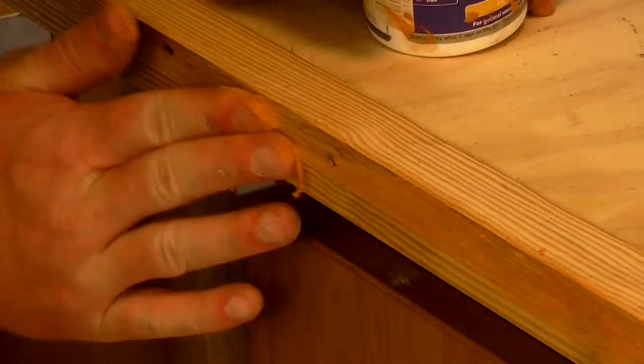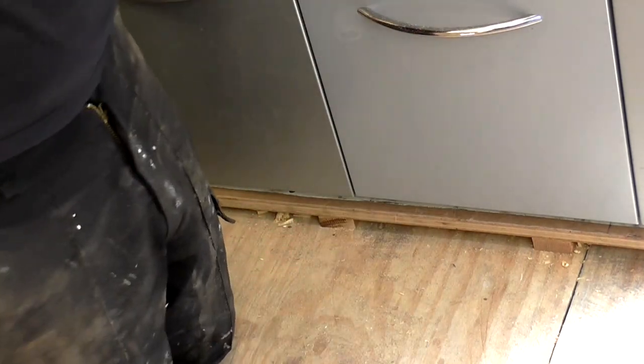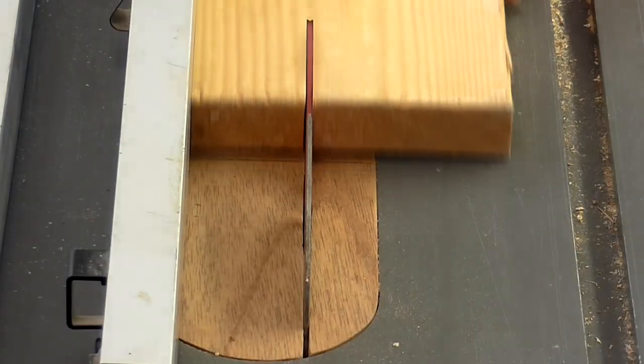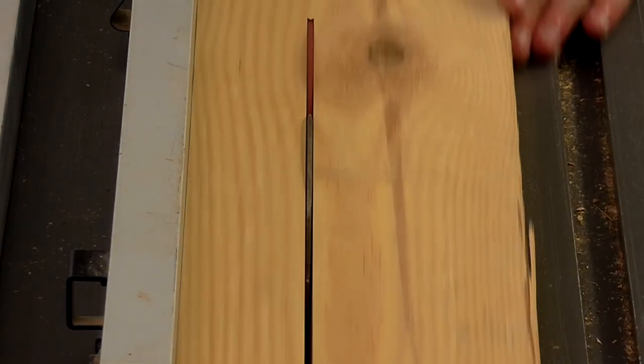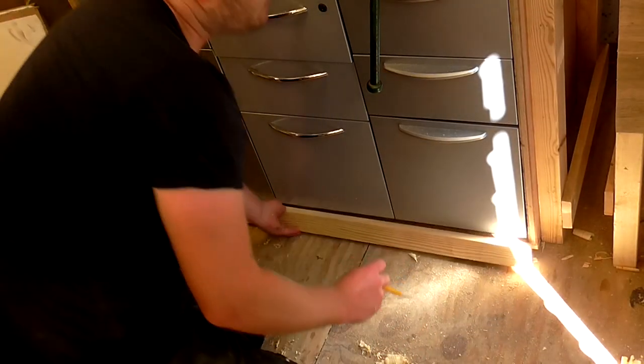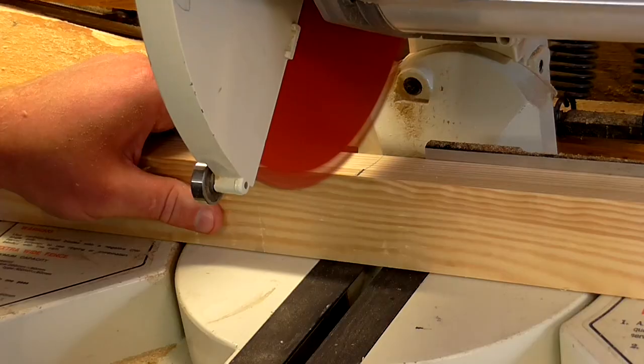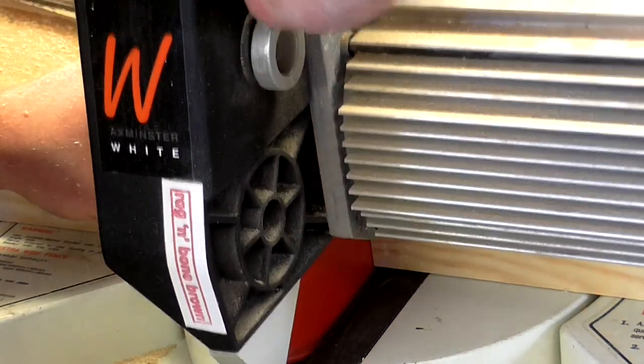I used a light wood filler to fill the nail holes. Next I wanted to trim the bottom of the plywood box — this piece of trim would be wider than the rest of the trim pieces that would cover the plywood edges of the box. I wanted all of the trim pieces to join with mitre joints, so I first marked up the length and cut it to size on the mitre saw.